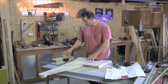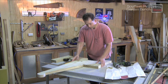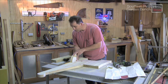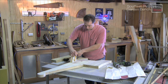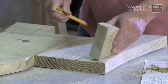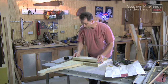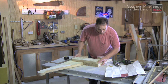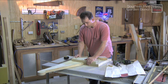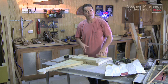To join our two pieces together we're going to use a two-by-six cleat. We put our two pieces together and use the scrap piece to measure in from each outside edge, making a mark on each side. The distance between those marks is the length of the cleat. We align it against the top of the shorter piece, drill some pilot holes, put screws in, and this one side is just about complete.